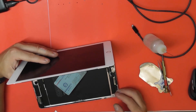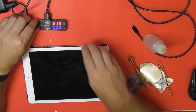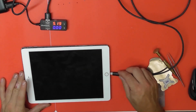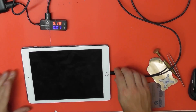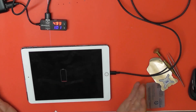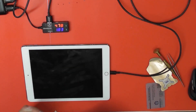They're all plugged on. We're going to remove this card. We'll bring our trusty little meter in — it's got the five volts at the ready. We'll bring our connector in and plug it in and see what happens. We've got movement! We have a battery symbol now coming alive, and we have the charging current going into the iPad — 1.89 amps, which is good, it's about what I would expect to see for this iPad. We'll just wait a little bit of time and see if it actually turns on.